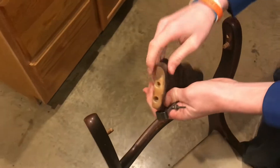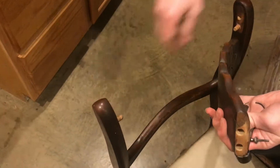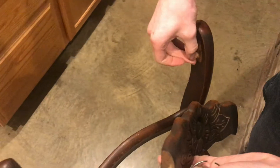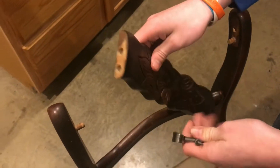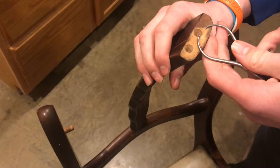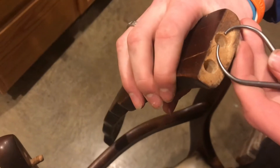The top pin on this chair broke off on both sides, so we'll need to clean up these holes. It requires a 3/16" dowel rod, a diameter we don't have in stock, so I'm going to lathe it down. I have my calipers marked right to the sides of the hole. Now let's go ahead and lathe down the pins and then install them on the chair.